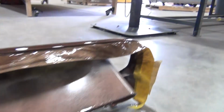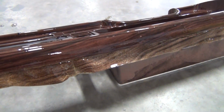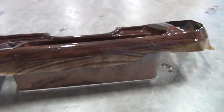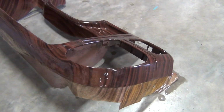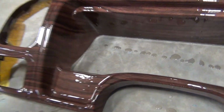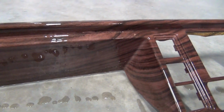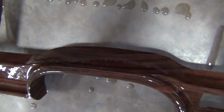You can see that on the back side there, it's just mainly taped, nothing fancy, just something real quick, just enough to get the tape to stick to the back edge and give it a little bit extra to go around the entire part. We've done that all the way around, and it makes it to where whenever we dip the part, everything looks a lot more uniform and goes all the way around the entire part. Another thing is, by doing it this way, we were able to go up inside here quite a bit. We'll probably come back in and still darken that area in like what we talked about with the customer, but the actual dip itself looks really good.